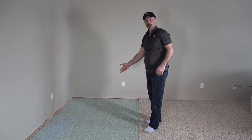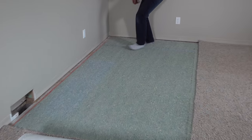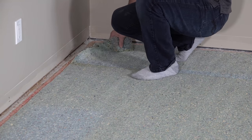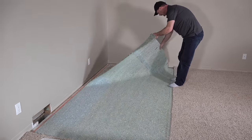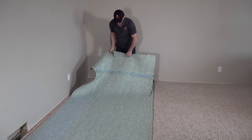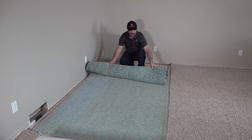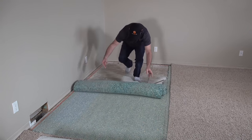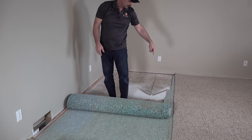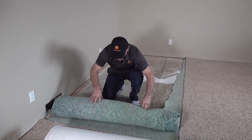So now you've got a manageable piece that one person can carry out on their own. Now in most cases you're going to find that you've got an under pad as well and it's going to be held down — maybe glued at the perimeter or in a few spots — but for the most part it's going to be held down with a bunch of staples. So if it's just stapled like this is, it's really easy, it just pulls off those staples. I'd recommend wearing shoes, which I'm not, because now we've got all these staples exposed on the floor. Same thing, just roll it up. You may have cut it where you cut your carpet or it may be a seam or whatever.